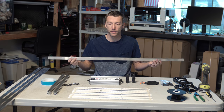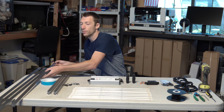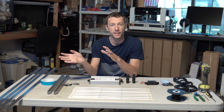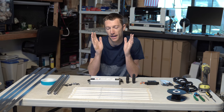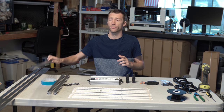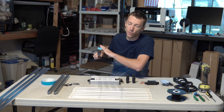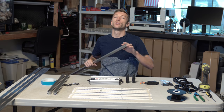And if you find a heatsink out there, an alternative, I would say your benchmark thermal would be you're looking for around 10. This profile is 14 degrees C per watt thermal resistance, and I would suggest ideally you'd want to hit around 10, which would be a really nice profile to get. So somewhere between 14 and 10, if you're looking for alternatives. Otherwise, heatsinkusa.com, 1-inch profile, 46-inch lengths for 4-foot builds, 23-inch lengths for 2-foot builds.